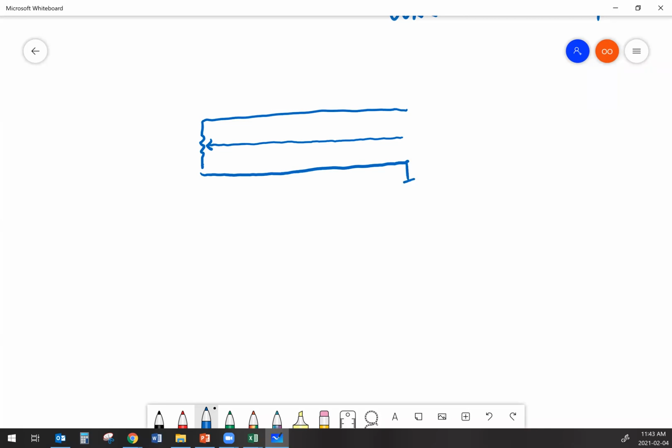So if I have a 3-wire sensor, and I'm going to do this very simply as a potentiometer. A potentiometer is very easy to understand how it works. We're going to show that we have ground, we have our analog to digital converter inside the ECM, and we have a 5-volt reference inside the ECM.